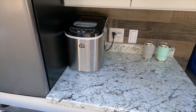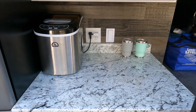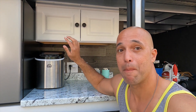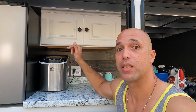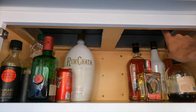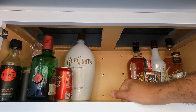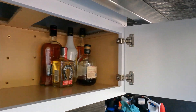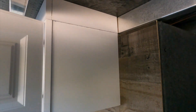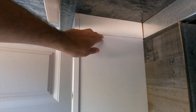We actually have more than 13 inches of space between the countertop and the cabinets. The total dimensions of the cabinet are 12 inches, but when you open the top, the wood framing came down so the inside measurement was only 10 inches. What I did was get two-and-a-half-inch strips to match the cabinet and secured them to the top, then cut two holes in the top so that bottles could actually fit all the way in. The doors also swing 12 inches, which is perfect — they clear the frame. You can see the extra strip we added to give the cabinet more length.